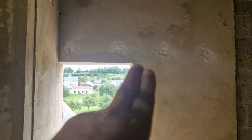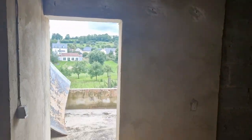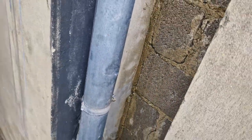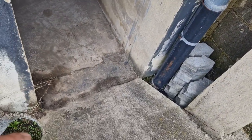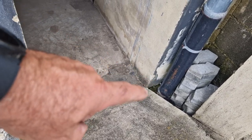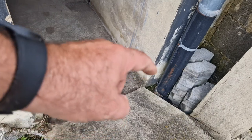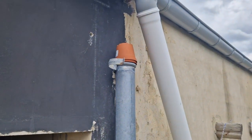Next we have to put the flat metal rail up on the wall. You can see where we removed the old rail. There's a bit of a slope here, so we're going to correct that later on. It works out good because there's a gutter drain sitting right there. With that gutter drain, the plan is to put a trench here, cut the cement, and then put a drain that goes down, because that gutter isn't hooked up anymore.